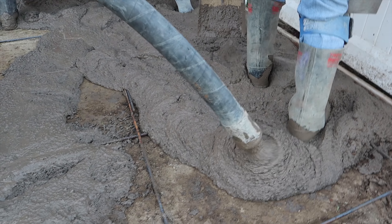When you get on the concrete early, the big knee boards come in handy because metal sliders don't cover that much square footage on the bottom of them. With the weight, comparing them to knee boards, you're going to sink and create holes — a little bit more hand-floating work.